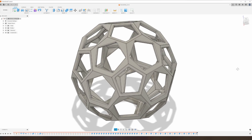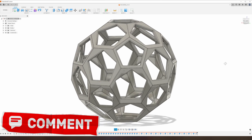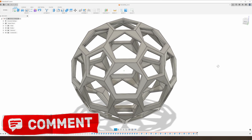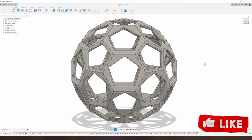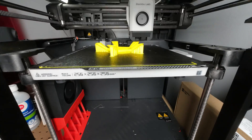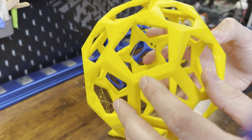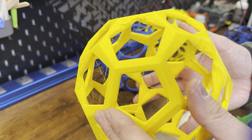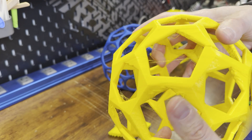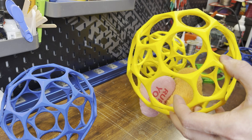I replaced the holes with pentagons with the points facing upwards, which removed most of the horizontal areas, but this also increased the thickness of the areas between the holes, pushing print time to about 16 hours. So I decreased the infill back to 10%, which brought it down to 12 hours. The print completed fine but had the same overhang issues — changing the holes had little impact. The thicker profile and not being solid actually caused the print to crack when squeezed, so it's pretty much a fail all around. But the first print was still good enough to test with, so we'll go with that.